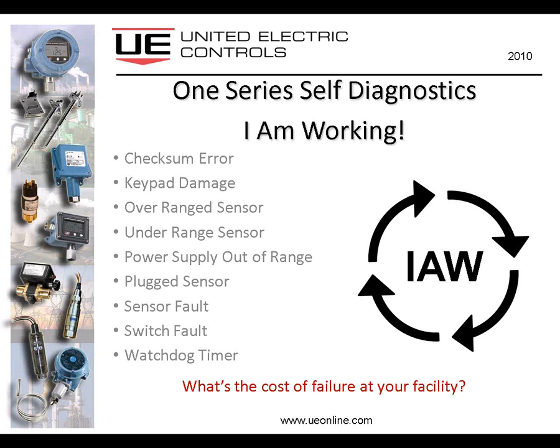Also, an overrange condition on the sensor, underrange condition, the power supply itself being out of range, the sensor being clogged. If you have impulse lines that are clogged, the 1 Series knows about that and can report it. The sensor itself, is it open, is it shorted? The switch, same, it can detect that. And finally, there's a watchdog timer. This timer is expecting certain things to happen at certain times during a cycle of the software inside the 1 Series, and if it doesn't happen when it was designed to, the 1 Series will report that type of error called watchdog.